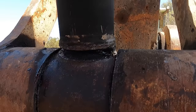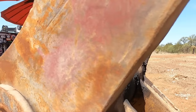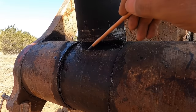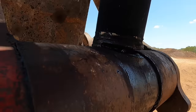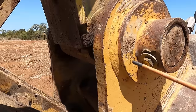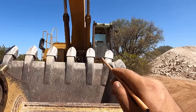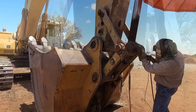I'll leave it a little shy of flush on this half, and then run a weld around the perimeter. Is this the proper way of doing it? Who knows? But if it works, it works - and this works. I've done it before. The customer ended up telling me that the pin slid out enough that that ear over there didn't catch it. I don't know how the operator didn't see it - it's a direct shot. It slid out enough to where it just snapped, because these pivot and then snapped it right off. Either way, let's wire weld that.